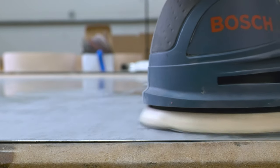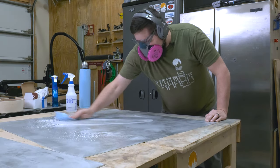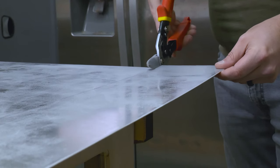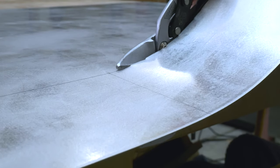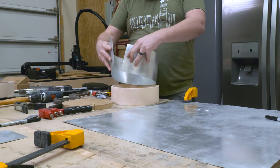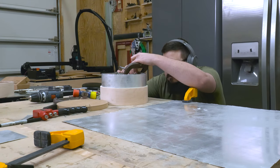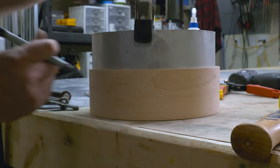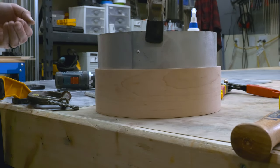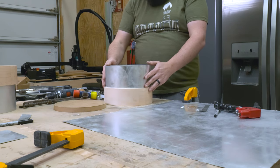The first thing is to sand both sides of the aluminum sheets with 320 grit and then clean them off. From there I mark out the width for my shades and cut them using tin snips. Due to the size of my lamps I needed to buy three sheets of aluminum to ensure clean edges on all exposed edges. I used the interior of the wooden circle to shape the metal circle, then added a couple of rivets to hold the aluminum in place. I overlaid the aluminum by about an inch on the interior which gave plenty of room for the rivets, resulting in a nice friction fit.